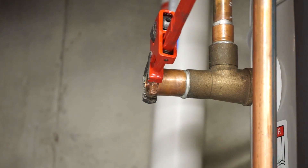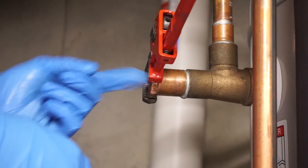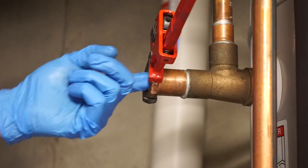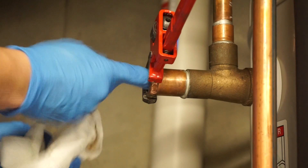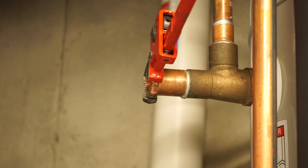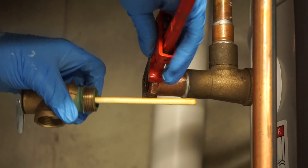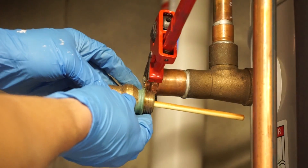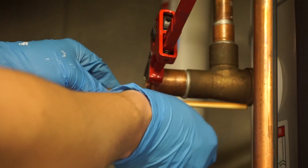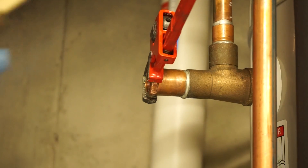While you have it open, it's never a bad idea to gently wipe the inside of that fitting. The big thing you don't want is to leave any lint or debris in there. Now, one thing you might notice is that this probe is a certain length and it has to extend into the tank. When this was installed, it really doesn't reach in far enough per the design. So one of the first things I'm going to do is replace this with the correct size — I'll show them next to each other so you can see it.